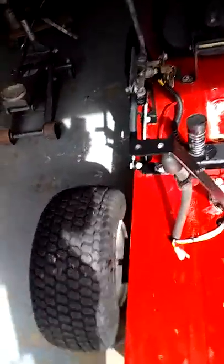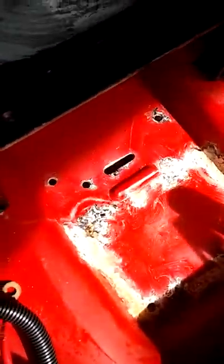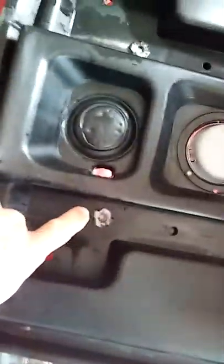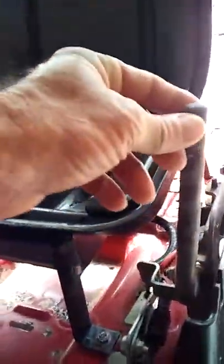Parts are starting to come in. As you can tell, I've put the naval jelly everywhere. You can see what it's doing — when it turns white like this, it's actually neutralized the rust. It killed it. You can see where it actually just pulled it right off, because this was rusted solid, and that one was rusted solid. These were rusted really bad up through here, and now it's just bare metal. Same with these — they came out really nice.